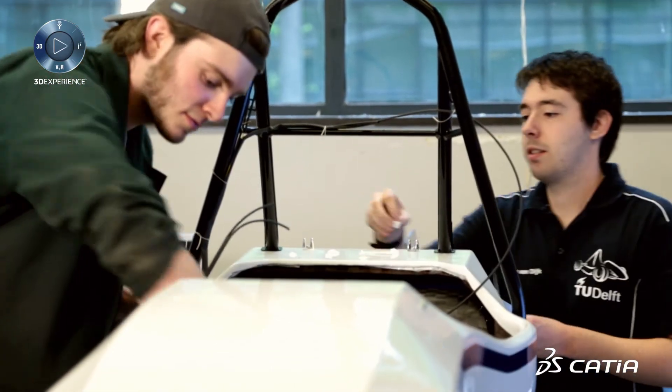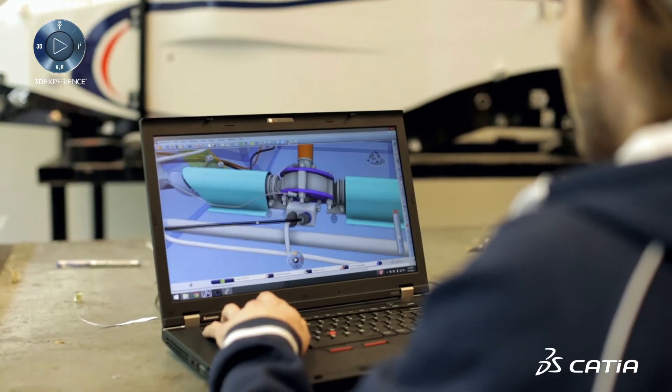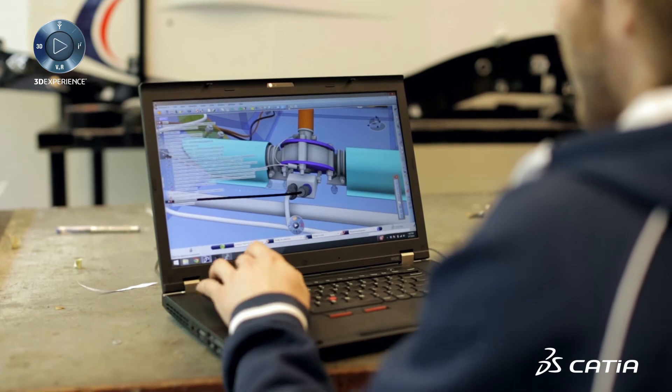It's also very important to have slack on your wiring harness in the right places — only where you need to move the connectors, and not in the rest of the wires. So we could really place it exactly the way we want and then put the slack on the right places.